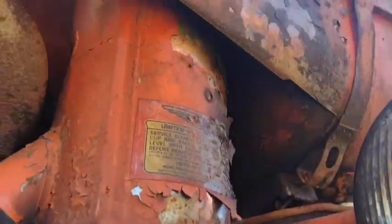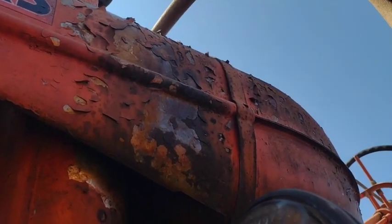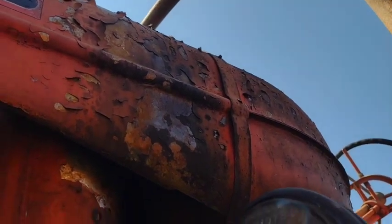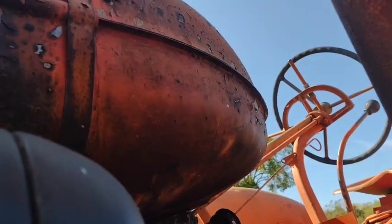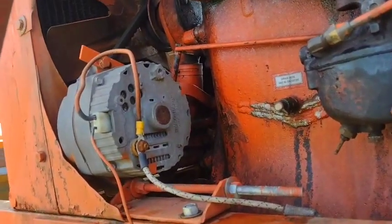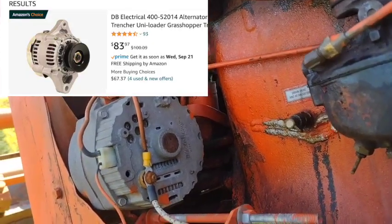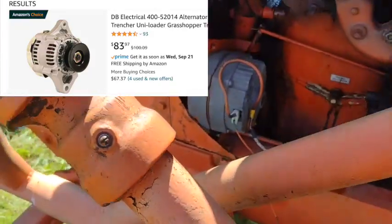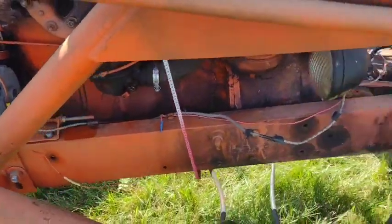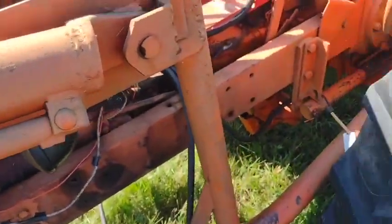This tractor had an electrical fire apparently - that's why they parked it. I'm told it was running about a year ago and it caught fire somehow and hasn't been running since. Considering that's the gas tank and that's where the fire was, they're pretty lucky they didn't burn the whole thing down. It does have some newer parts - somebody converted it over to an alternator, which is good. I personally like those little mini Denso clone alternators because they're about half the size but still have more than enough output to charge a battery and run a distributor and some LED lights.